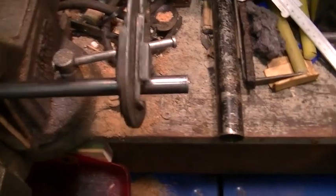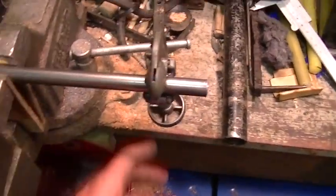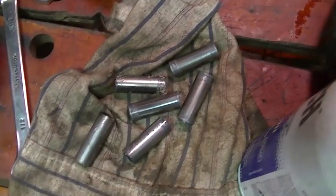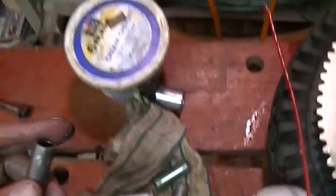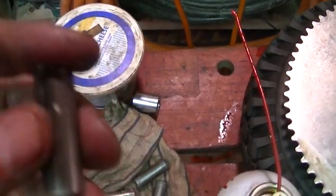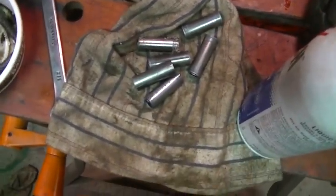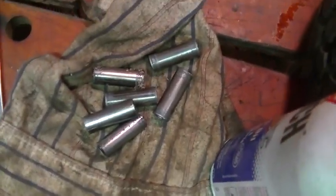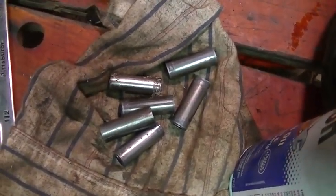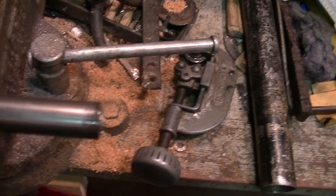Right about now I'm thinking, how am I going to get all six of these spacers and bolts to go in at the same time? I guess we're going to find out. That's six - straight from the factory. On the last one I noticed the first one I made was not exactly straight, and I used this to measure every single one. We're going to have to do a little filing to get them all exactly the same - we'll look for the shortest one first and make them all like that.